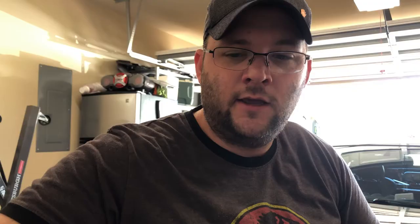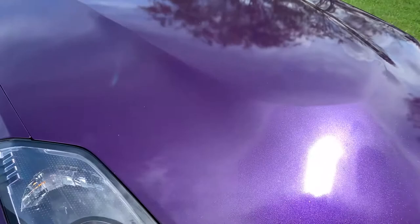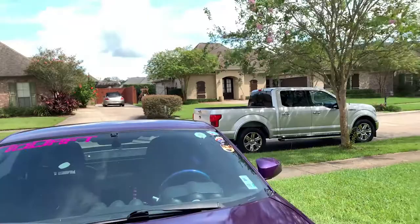I used quarter-inch fittings, but I hear you can get a little bit better spray if you use three-eighths fittings, because the opening is bigger and you get more airflow through. But this gun is also designed to run off less CFM, so in my head the quarter-inch should be fine — and it worked fine. I'll throw some stills and some video of the paint actually getting laid on so you guys can see it in action. The gun performed flawlessly.